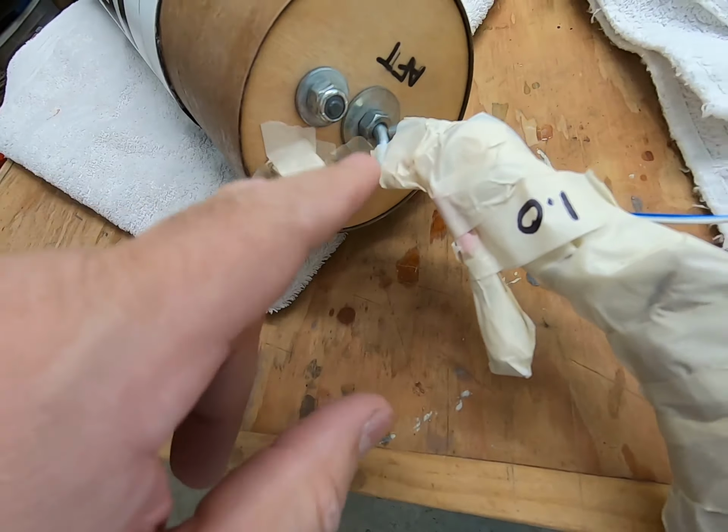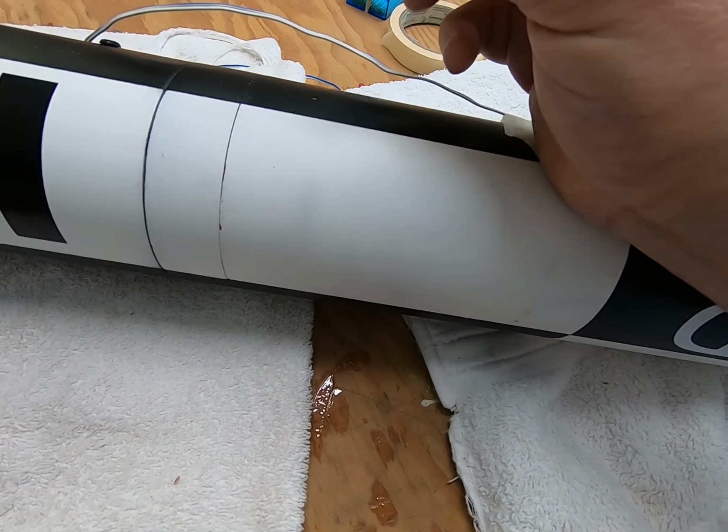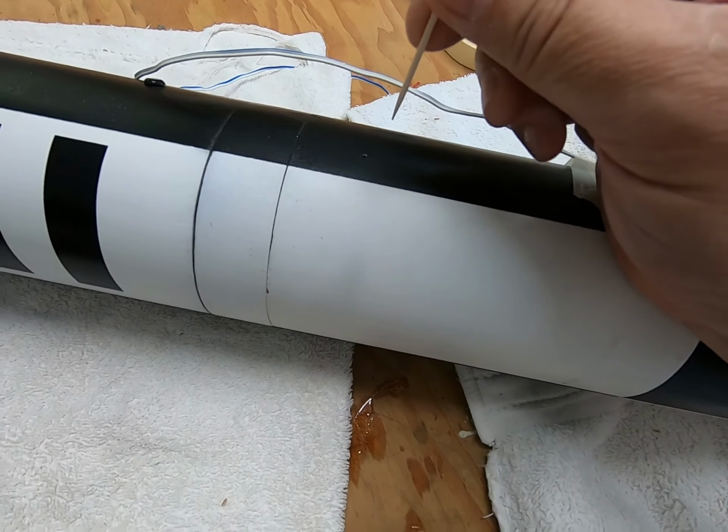Okay, so here's a low-tech OK Turbo shear pin, as I learned from Scott Binder. So a little 16th inch hole drilled all the way through. Stick this in, twist it, but then just go around, and break off that tip and leave it in there. So that's one little shear pin. Got one on the other side. Same deal.